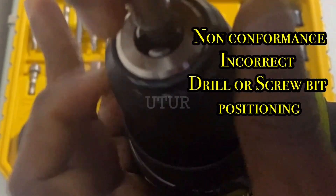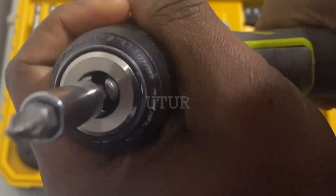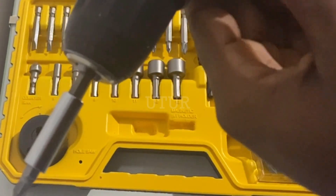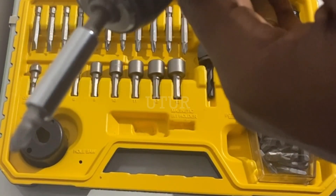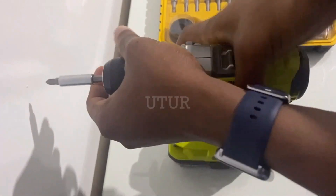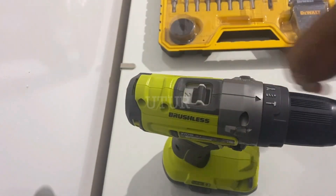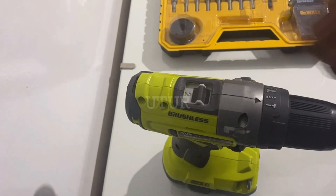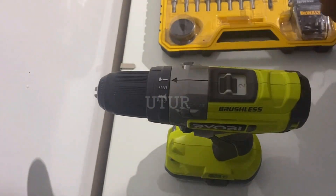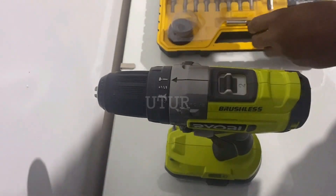You can see the magnetic bit holder isn't centralised in the chuck, so I'll be readjusting, realigning, and centralising it in the chuck grip until I'm confident it is at 90 degrees and perpendicular. When I squeeze the trigger the bit is no longer wobbly. Remember to set the speed to one when screwing. For tips on how to drill and screw wood bits and how to drill through metal, click the link in the description. If you found this useful, don't forget to subscribe, like, and share. Thank you for your time, goodbye.